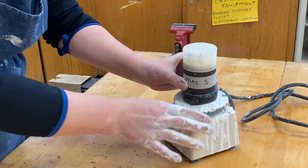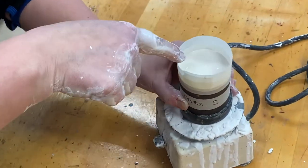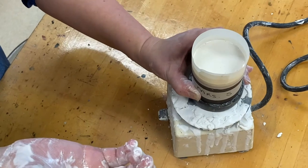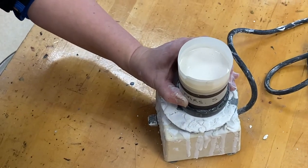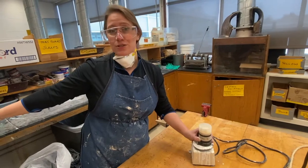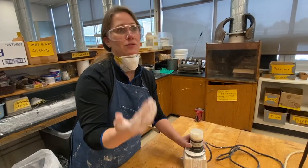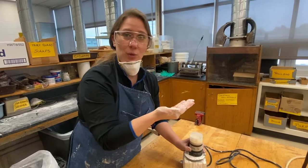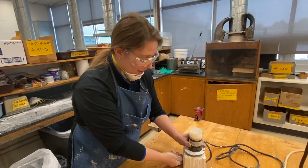Once the investment is poured, immediately place the flask on an investment vibrator set as high as possible. You can see bubbles coming up to the surface — I want to get all the air bubbles out so there won't be any excess metal bumps on the piece. If your piece floats to the surface, immediately take it out, dump it into the bucket in the sink, and start the process over. Wash it off before it gets hard, otherwise you won't be able to get your piece out. If it floats because the sprue wasn't connected well, rinse immediately and start over.